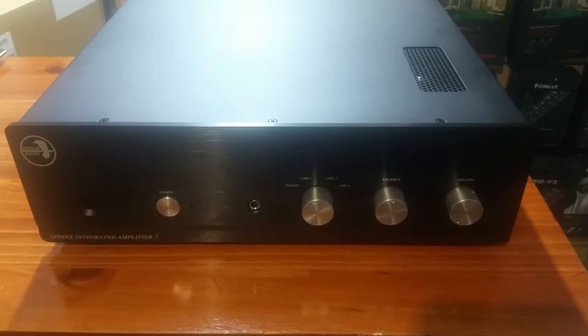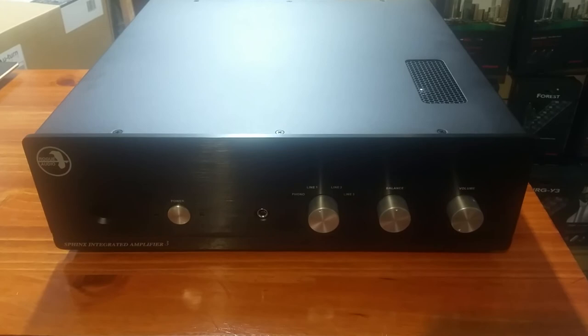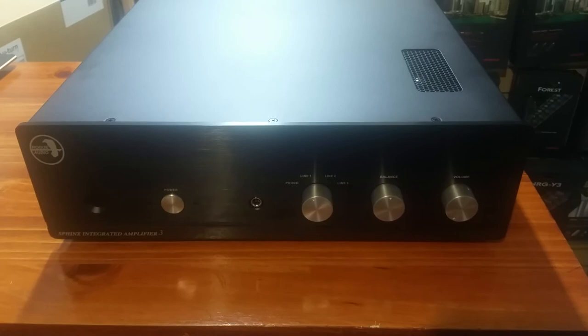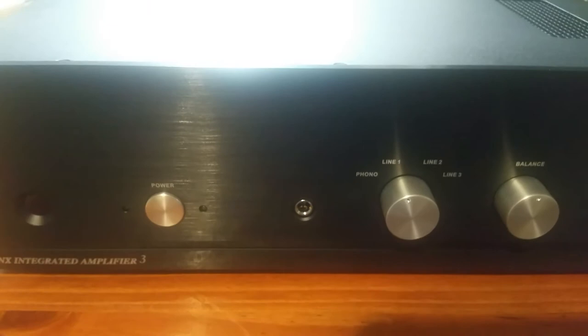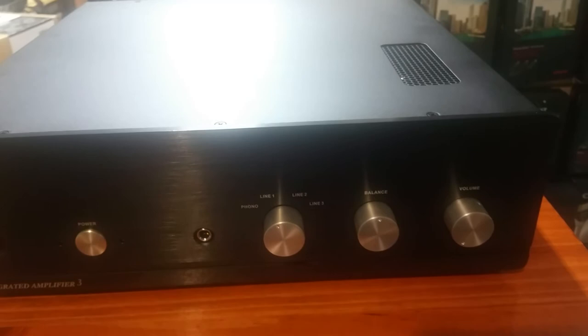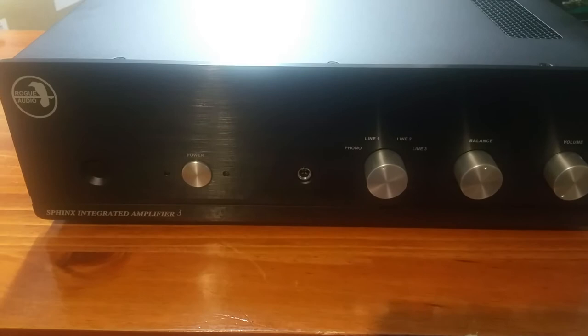What's the beauty of this amp over many others in the same price category? It definitely is the tube sound. If you're after that vacuum tube sound and you don't want to deal with the stress of power tubes, matching, and worrying about tube life, this thing is just foolproof. There's a headphone jack dead center, and in this version it is a MOSFET-driven headphone amplifier — from what I believe, discrete parts and MOSFET-based — which is kind of neat. So you can drive some difficult-to-drive headphones with the built-in headphone amplifier. This little spot here is just the IR receiver for the remote control.